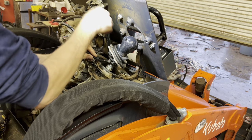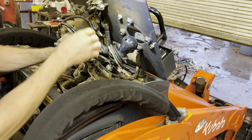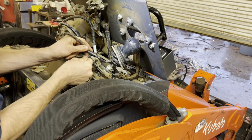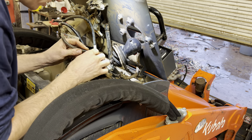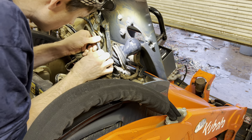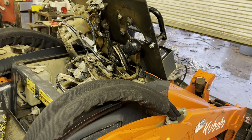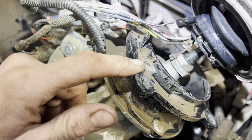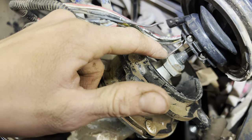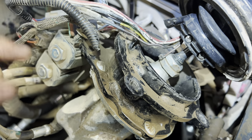I'm not seeing any damaged wires here — I think this section is fine. Something else has got to be messed up. I pulled it all the way off and found that the brown wire has broken. So I'm going to extend the wire from here to here — I'll probably just solder that joint.